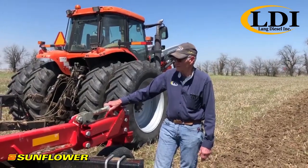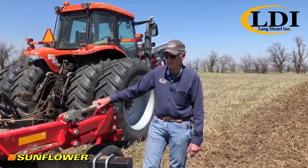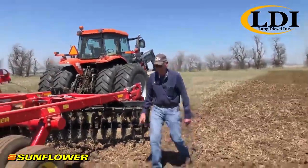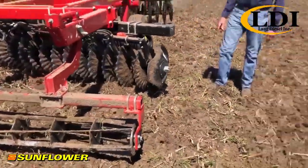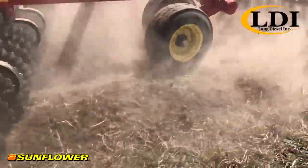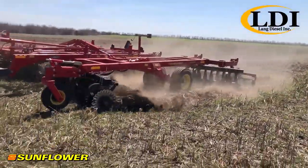This also features an 11-inch blade-type harrow rolling basket that we're running at about 700 pounds of pressure. Max is 800 — it goes from 80 to 800. When you run it at 400 you're running about the normal way the spring does. If you don't want to run it, you can lift it up.